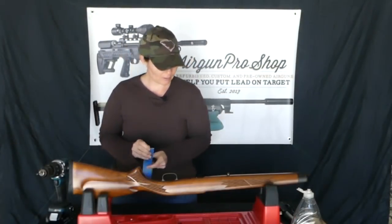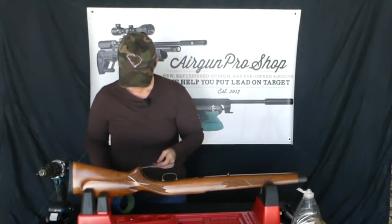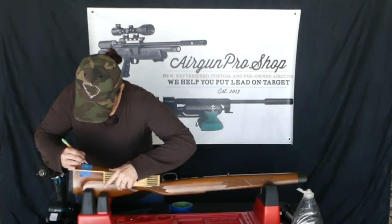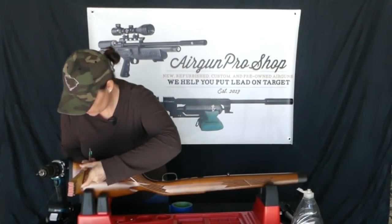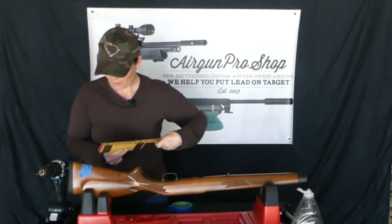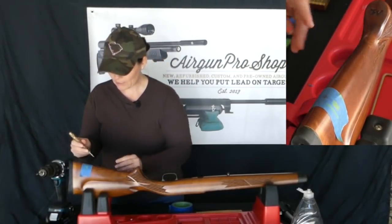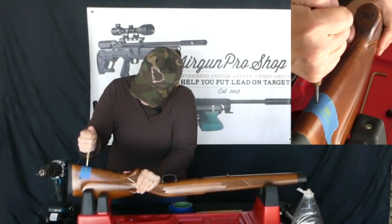Let me see about where I'm going to put it — it's probably about two, two and a half inches back from the butt. It looks about an inch and a half, so three quarters of an inch would be center. So that's about center. I've got my mark where I'm going to put it, about two and a half inches back from the butt. I've got my punch that I'm using — put the point in the middle of the X.